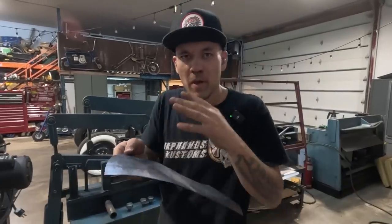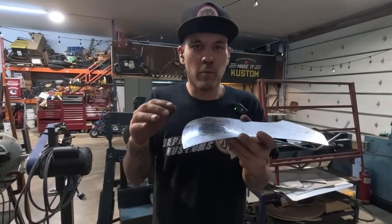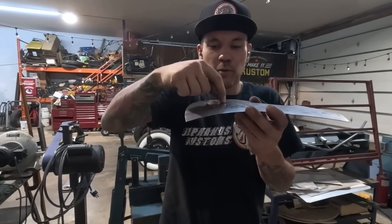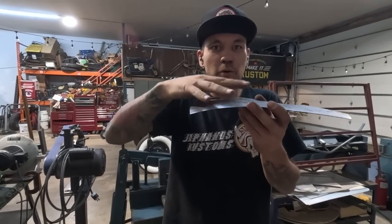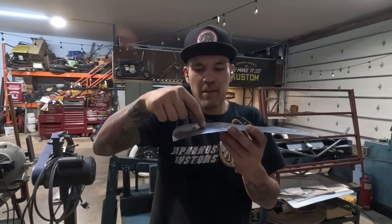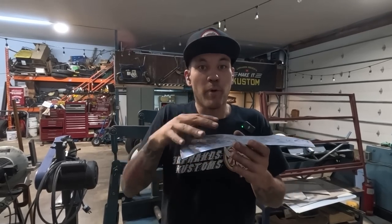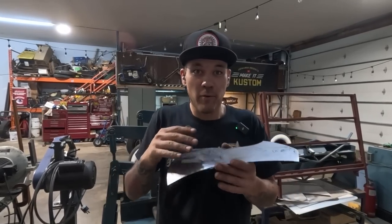So basically, when I'm using the power hammer to stretch, it's much like shrinking, where closer to the edge you need more shrink. Well, if you're stretching, closer to the center of your crown needs more stretching. So there's more hammer hits in this area than there is in this area than there is in this area. That's kind of how growing a bubble type crown works.